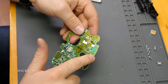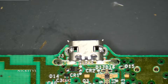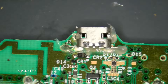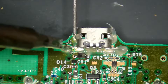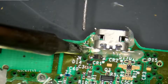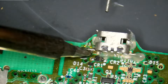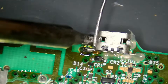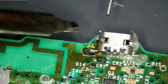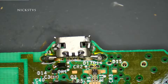And there we go. Now we can focus on our charger ports. We're going to start the desoldering process, which is first off with some flux. Let's start off with a little bit of solder — this is leaded solder — just adding a little bit to all these supports. Finally, I'm going to hit it with some hot air.